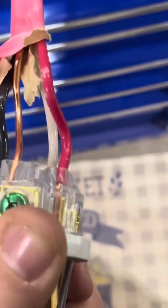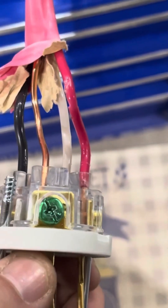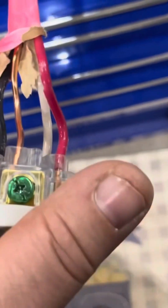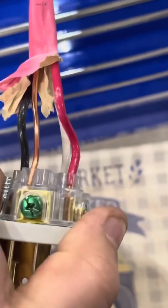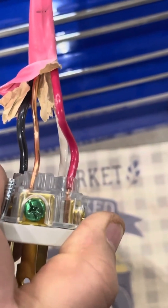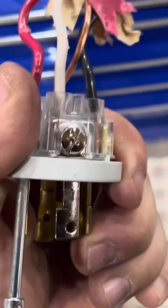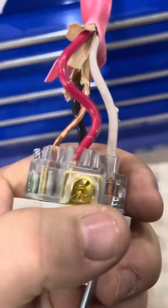Again, it's on each opposing side. You can clearly see the grounded bare wire there. It's pretty easy — it just goes to the green screw for ground. And then on the opposing side of that green screw, where you have the bare copper wire, you have your neutral wire, which is the white wire, and that screw is silver. So two hots to the brass screws.